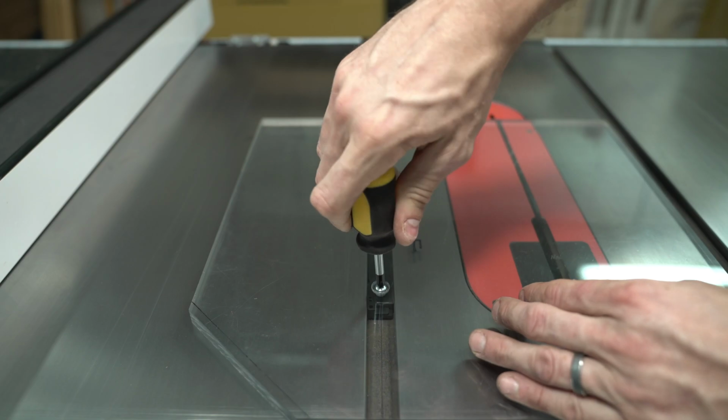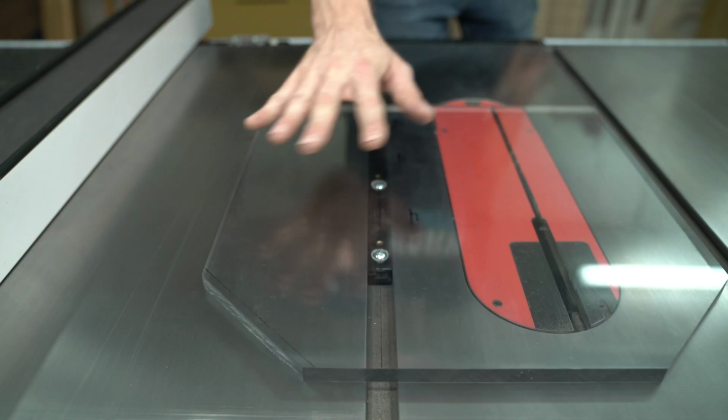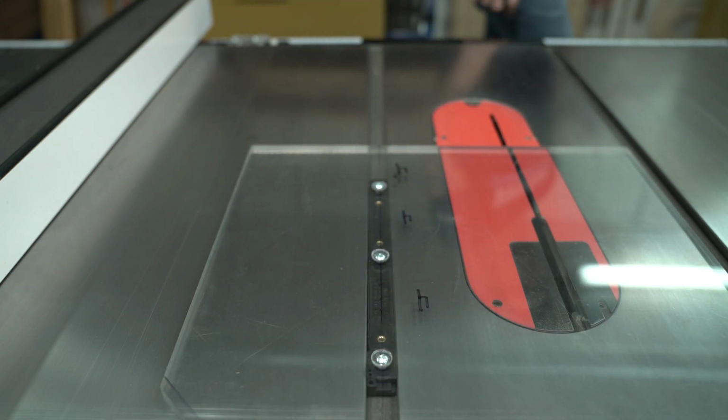using the 8-32 panhead screws. Don't tighten them down all the way just yet. Push the sled back and forth a few times to make sure that it moves freely through the slot but doesn't have any side-to-side play. If it's too tight, loosen the Allen screws and start over. You pushed too hard. I told you not to do that.